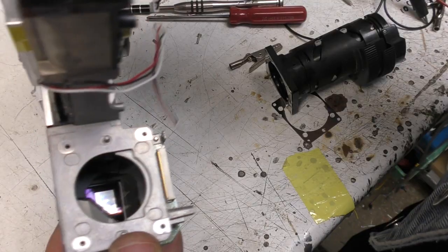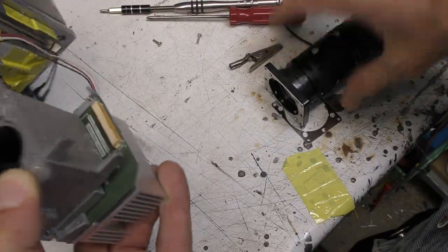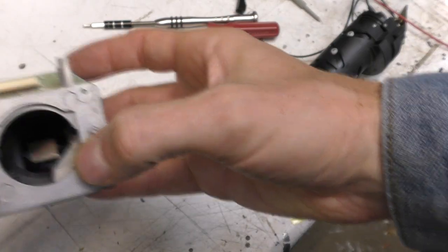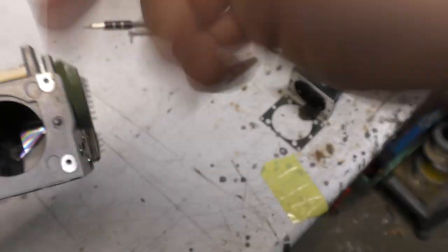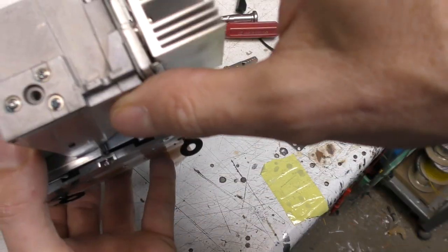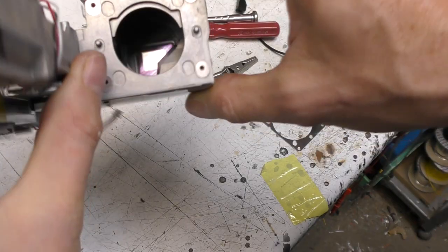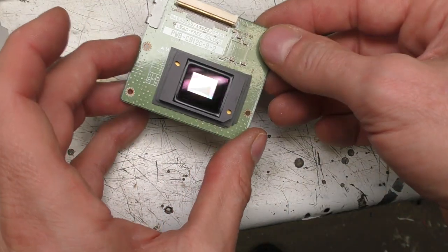Taking the lens off, we can see the front of the DLP in there and a mirror, so I think the light comes off the assembly, bounces down toward this mirror, then onto the DLP, and up through the lens. The panel on the side accessible via that flap appears to connect to the back of this mirror — that's probably a very fine adjustment for the mirror position to send the beam properly through the lens. I'm not going to touch those as I want to keep this projector working.